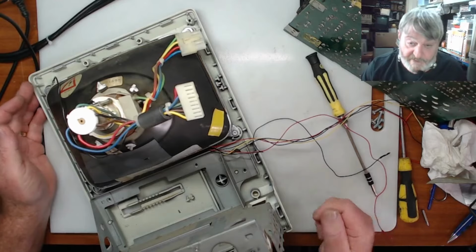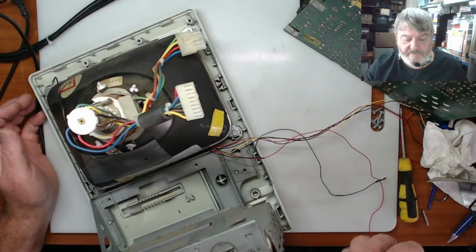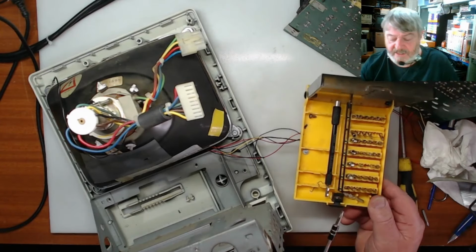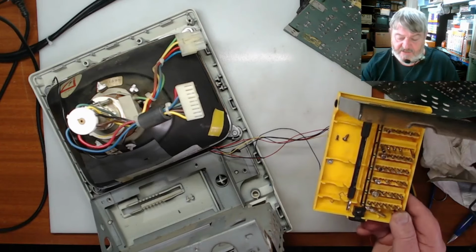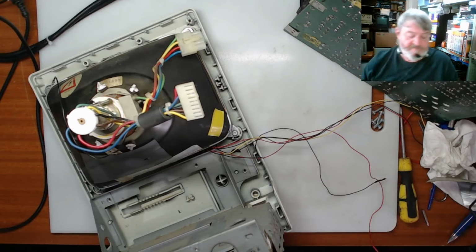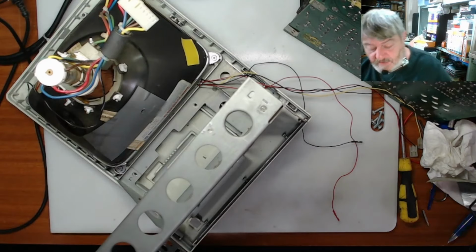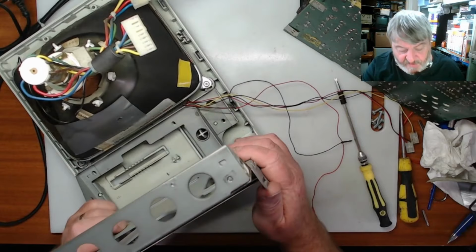Okay guys, I confess, it got the better of me. So I've gone through and I've taken the screws out that hold this metal frame in. And as I said, these tools are indispensable because with the Mac you do need long Torx drivers. Now, rather than buying a specific one for it, as I've shown you in the past, I have my kit that I got from AliExpress, and this has all the sorts of connectors and Torx heads and three-sided heads, all that sort of stuff that you need, Allen keys, and they have the extenders on them, and this gives you something long enough to get into the places you need to, down through here to in here, to go down in through the back here, and when you go inside the case, in the lid of the case, are long enough as well. So anyway, you need these sort of little tools to get on with it. So what I will do now is we will pop this off and we will see what is under here.